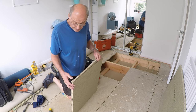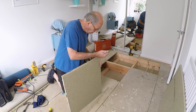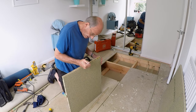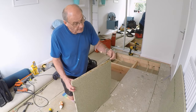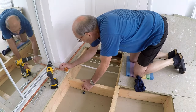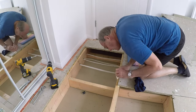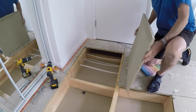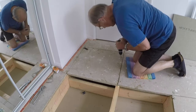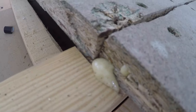This particular glue is a foaming glue — it expands to about three times its normal size, so you don't need an awful lot. I'm going to put glue down both edges. A bigger bottle would be easier to squeeze. It seems strange, but you dampen this edge first — then lay it in position and put the screws back.